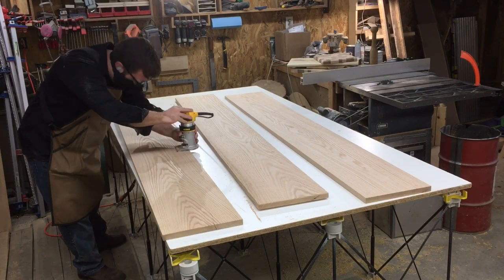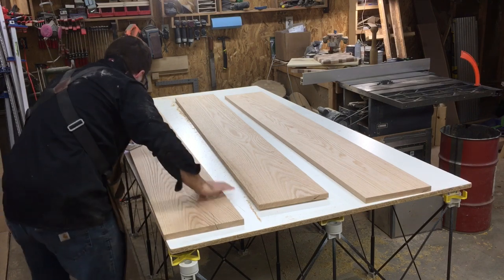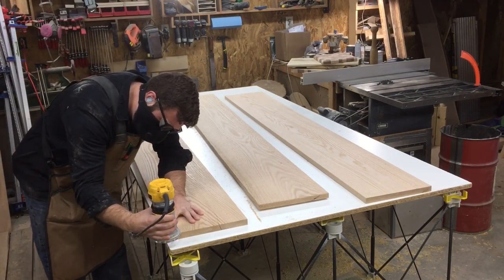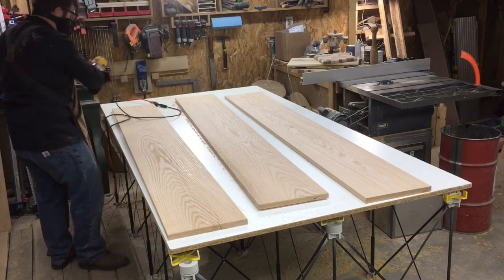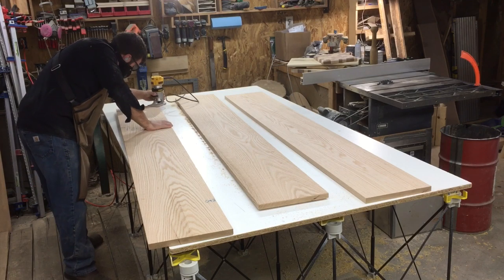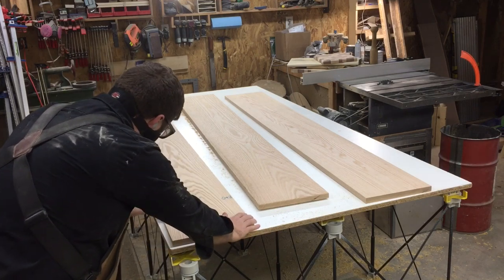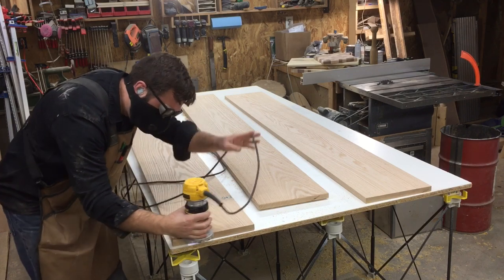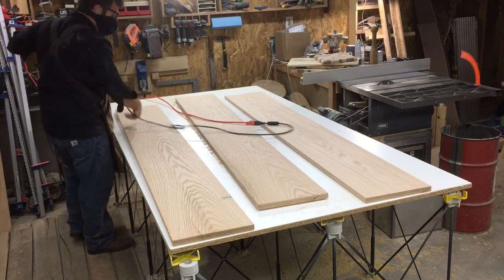You can see I'm going over all the edges with a quarter inch round over bit. It just makes everything a little bit more uniform, a little bit easier to the touch — no harsh edges or anything like that. We're not going to be doing a ton of sanding on these. The round over is just to break all the edges, get any splinters, anything from chipping out. That would be a disaster on oak — everybody knows it splits really easily. You've got to pre-drill it for everything. Rounding over the edges really helps mitigate that, so we won't have any problems with anything chipping or tearing. I really try and make this to where it's going to last a long time for my clients — they're paying a lot of money for them, and I want to give them a good product. That's why we're going all the extra effort with the routing.